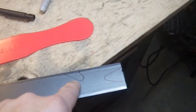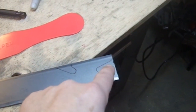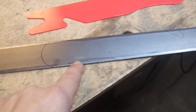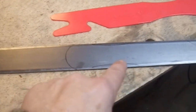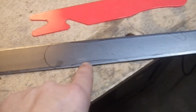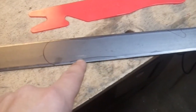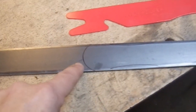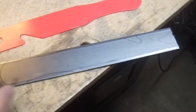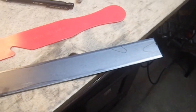It will also do the straight cuts for these before I get out the... On this one I'll probably just use a flap wheel. But on this here, I'm going to use probably the metal grinding wheel first, and then a flap wheel to see if I can get as close to that as possible, because that's going to be a lot easier to take off with a metal grinding wheel than with a flap wheel. I'll just use the flap wheel for cleanup. And in this, I'll probably do a straight cut and then two corner cuts. So once I get it drilled and a rough cut, we'll come back and I'll show you how it looks at that point.